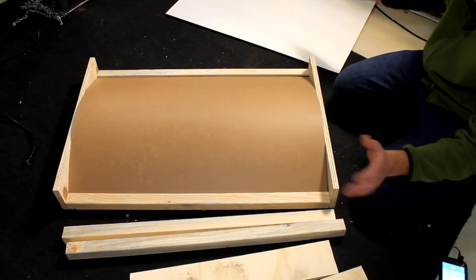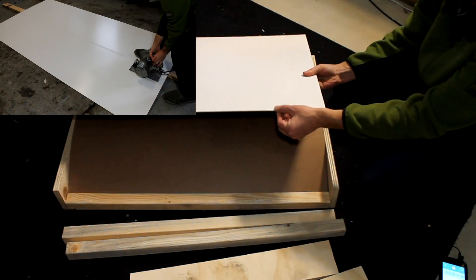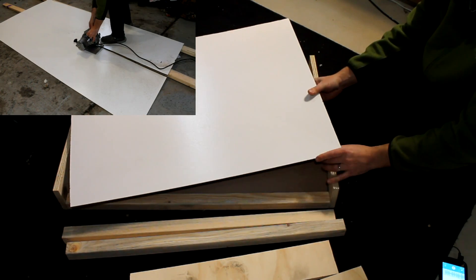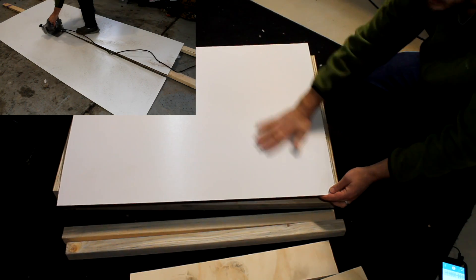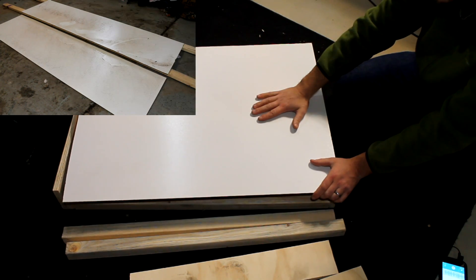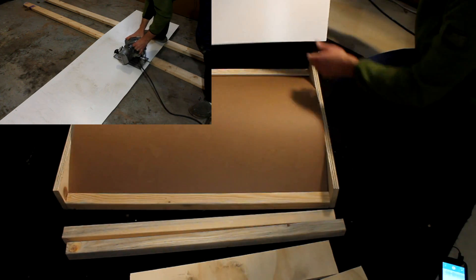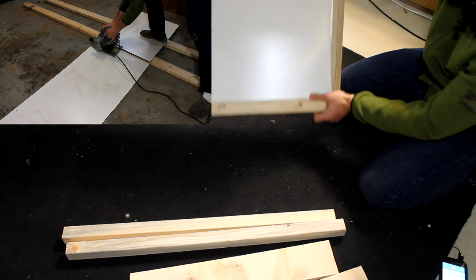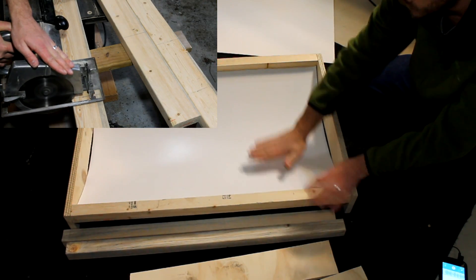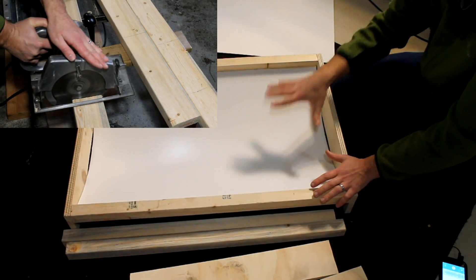You can make this custom to whatever you want. Basically what I did was I started with a piece of quarter-inch melamine — it's very cheap, less than $10 for a 4x8 sheet. It's easy to work with, has enough flex for what I needed, and it has a reflective coating so I don't need to do any additional coating on the inside of the light. I made a frame and bent it into a parabola shape, which gives a good light reflection straight down and side to side.